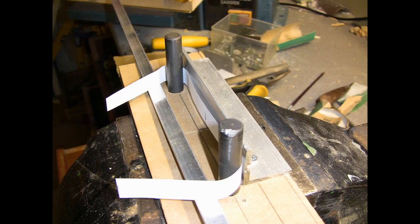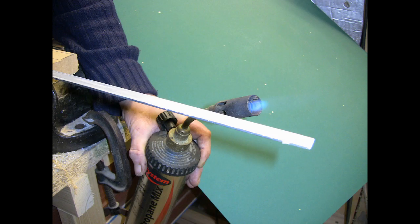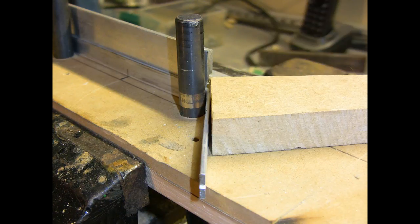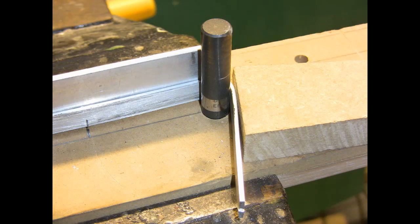Cut your piece of aluminium to length, rub it with household soap, and then get your blowtorch and heat it up until the soap goes black, and then leave it to cool. That is called annealing. Now the piece of aluminium is a lot lot softer, so it's a simple job now to just work the aluminium round the drill with a block of wood — and that soon creates the outer strap for the drop link.